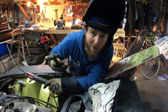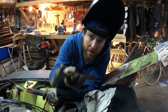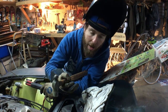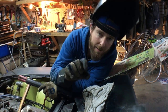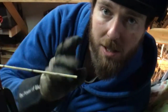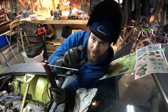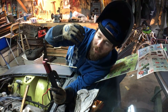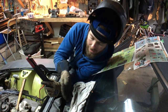This is a slow process — you're laying basically one bead at a time and then building each weld off of the previous one until you get it up and out. What's really cool about this technique is that even if you're down inside of a hole, the flux on the welding rod will actually protect you from arcing out on the threads. So you can weld a bolt that's deep inside a hole, build the weld out until it's above the surface, and then weld a bolt to that in order to turn it out.